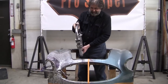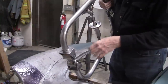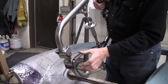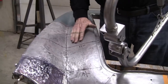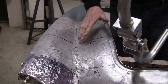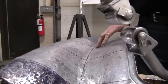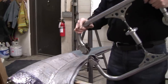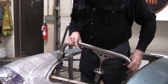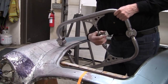Let's see if it works. What are the alternatives to this? We've got two-inch wheels on here, two inches wide, two inches in diameter. And we have a situation where this has got a really strong shape convergence here with a reverse curve in here. The question is, why use this rolling mobile English wheel versus a planishing hammer?